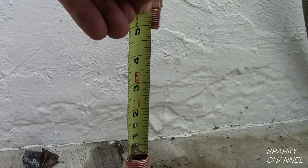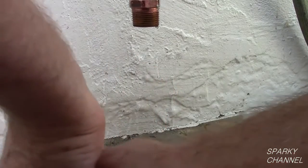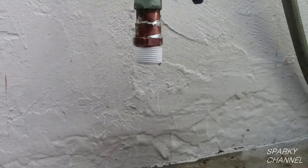For this model you will need 5 inches of clearance between the ends of the fittings. Put Teflon tape on the threads of both fittings.